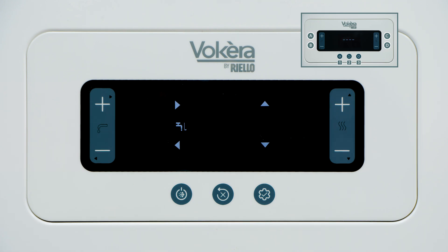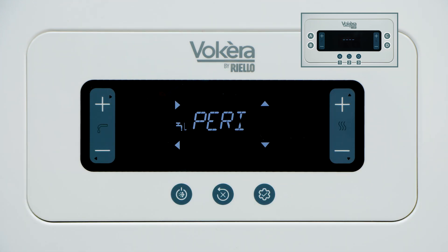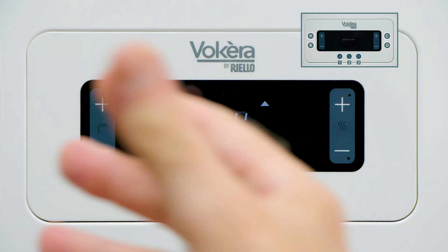Preheat will work for one hot water cycle and then stop, so you'll need to briefly blip open and close the hot tap each time you use hot water and the boiler will preheat for one cycle. A press on C will bring up comfort superior. This setting means the boiler, if it's in heating mode as well as hot water mode, after every heating cycle supplying water to the radiators or underfloor heating, will check its internal temperature and the temperature of the domestic hot water plate heat exchanger. If it falls within certain criteria, it will use the heat already in the system to pre-warm the hot water section rather than let the boiler get cold. When you've set the option you wish, press button A to lock that in place. To return to the main screen, either wait or use button B.